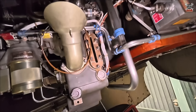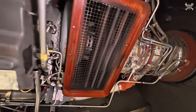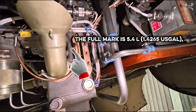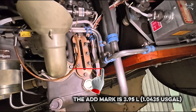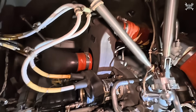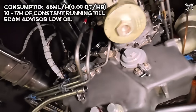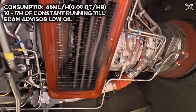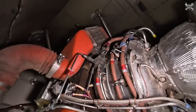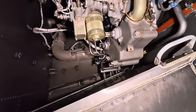Since we found no leak, we add oil to the oil tank. The oil quantity of the gearbox sump at the full mark is 5.4 liters and at the add level is 3.95 liters, giving a difference of 1.45 liters between the two marks. Consumption of the APU in good condition is around 85 milliliters per hour, which gives roughly 15 to 17 hours of constant running before hitting the add mark. At that point the pilots get a ECAM advisory for low oil level, and even with this advisory the APU can safely run for another 10 hours.